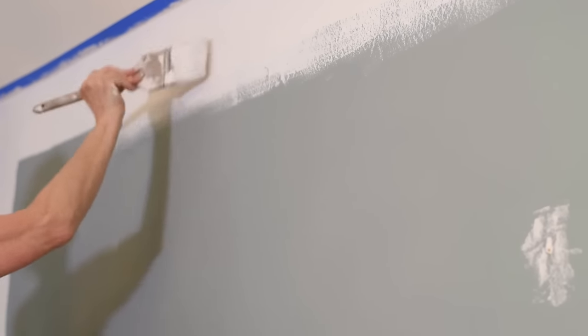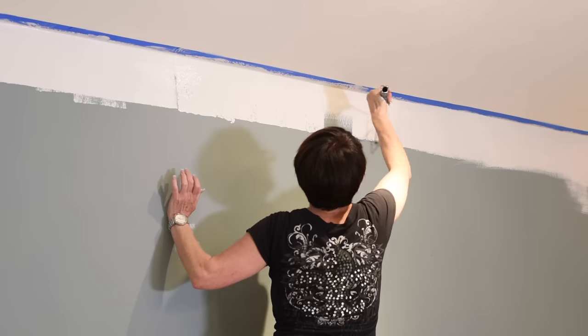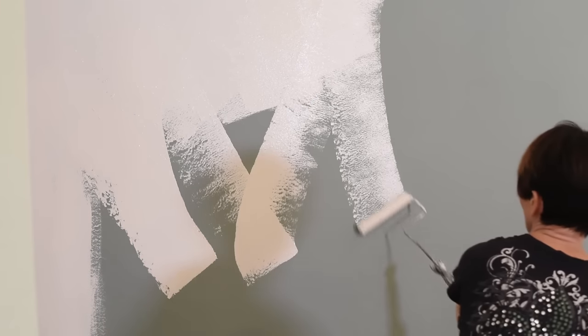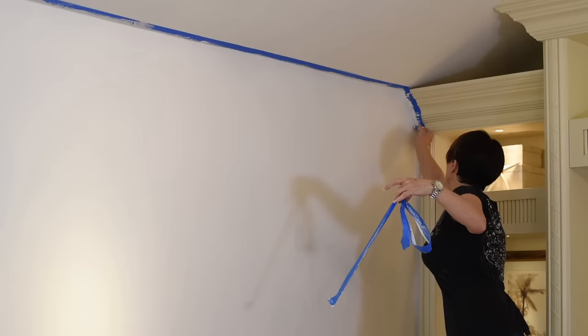First I'm going to cut into the walls around the edges. Brush out and feather out the edges so you don't see any brush lines. Once you've got your perimeter, apply paint to a roller and use what we call the W. Roll a W onto the wall working in about a 36 by 36 inch area — this creates an even distribution of paint. Then continue rolling from the top edge of the wall to the bottom. Once the coat of paint is on, pull off the tape.